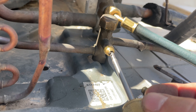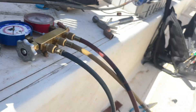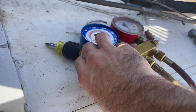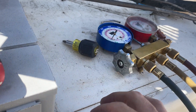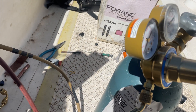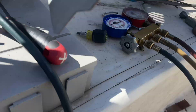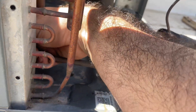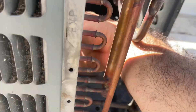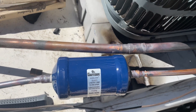After you do that, put your Schrader valve back in. We still have the nitrogen hooked up — I'm going to slowly open this. I'm going to open my suction valve and feed nitrogen through the suction side and preset this to about 200 psi. I'm also going to feel around all the joints that I brazed and see if I feel any air. Make sure that you let these pipes cool before you go feeling them.